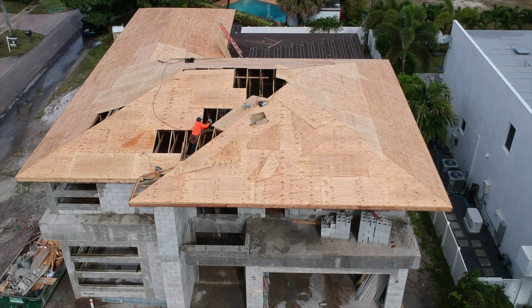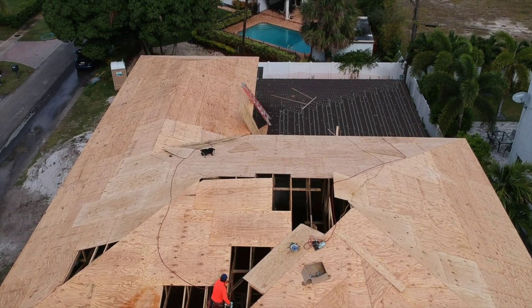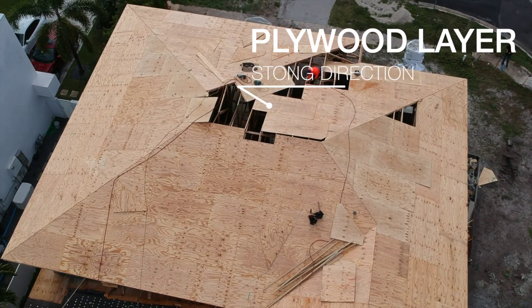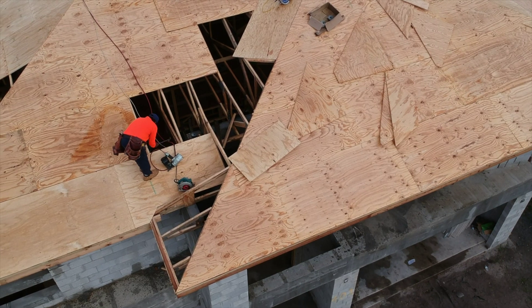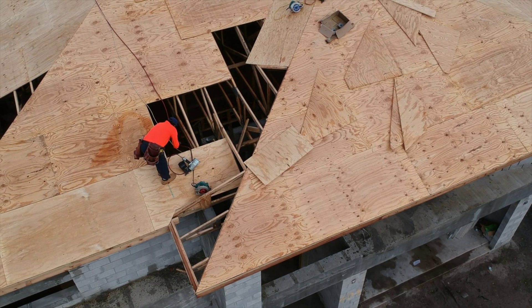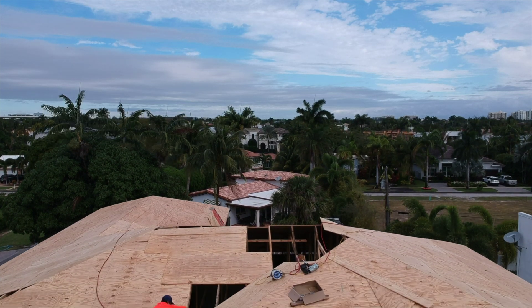Let's rewind. Roofing on residential houses like this one is typically fabricated using plywood sheeting nailed to roof trusses. The type of sheeting may vary, but this structural layer is installed in the strong direction and always ends on a truss, providing strength for gravity and uplift. The sheathing also locks the roof trusses and building frame in place, keeping everything square and plumb.